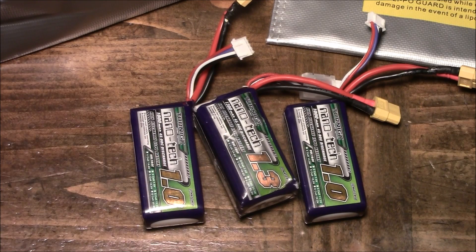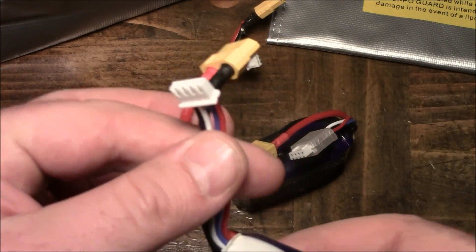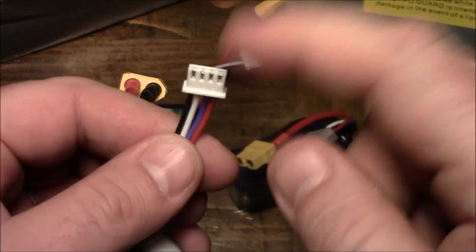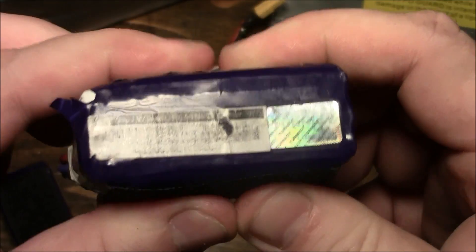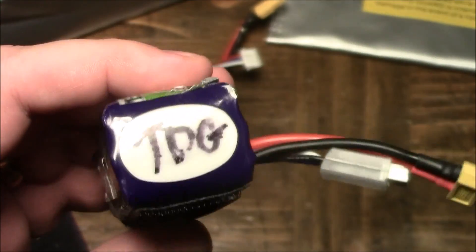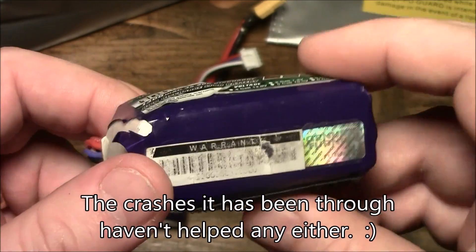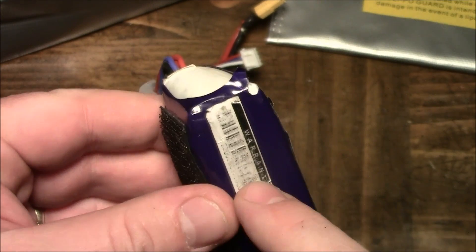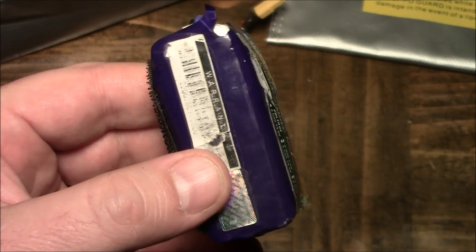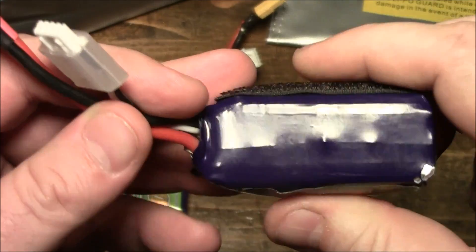You can also over-discharge a battery and that can cause it to explode too, though I haven't ever seen that happen. What I always recommend is using the balance port every time you charge your LiPos. If you over-discharge your battery, you'll end up with a nice puffy battery like this — it's squishy and this one now only lasts about a minute and a half or two minutes, when it used to last six or seven. Now, a puffy battery isn't necessarily high risk, because the risk comes when your cells are unbalanced. These cells are all equally puffy and equally chargeable, so even as puffy as it is, it's really not a big explosion risk — the explosion comes from one cell being too full or too undercharged.